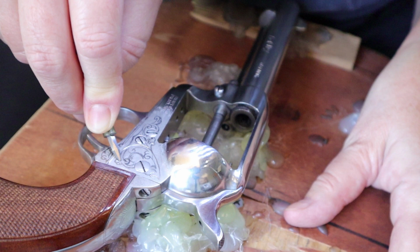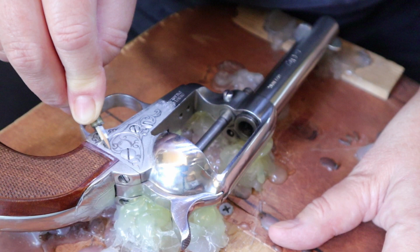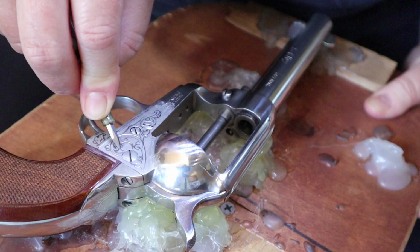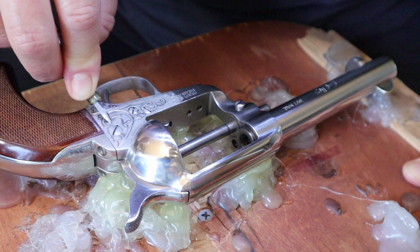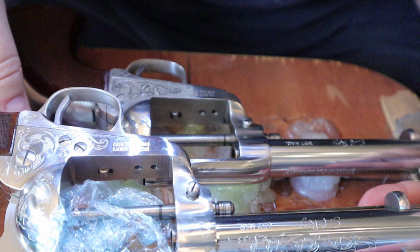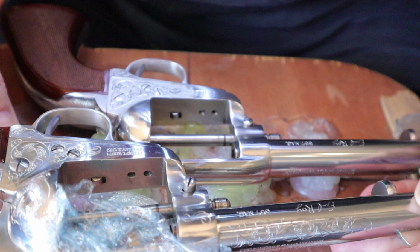I'm moving the work into the graver with the left hand, and with the right hand cutting and rotating my wrist so that it handles the bevel of the cut. And I'm always comparing it to the other piece to see if I can get it matched up. I didn't want to film the actual designing of this. I develop it as I go.